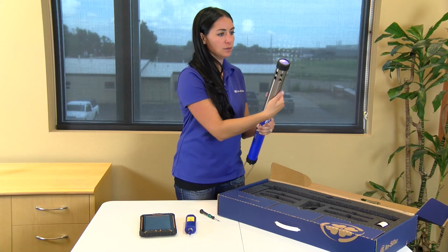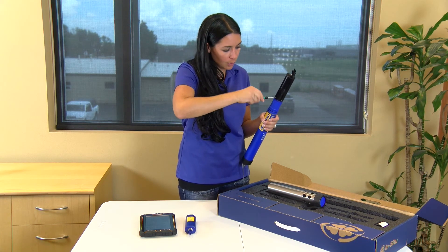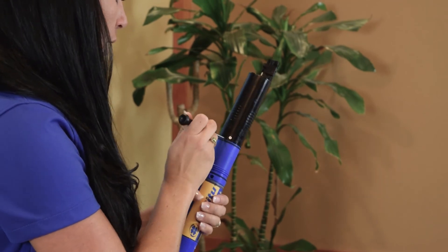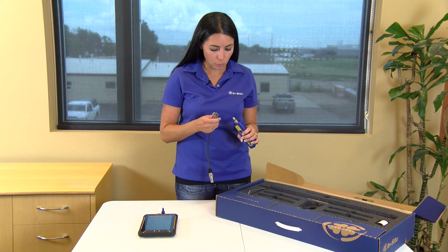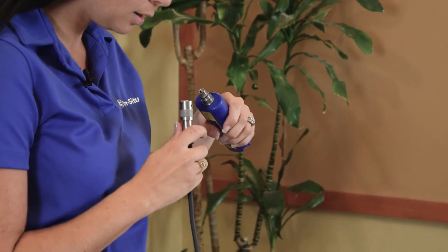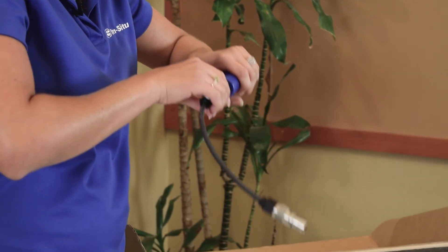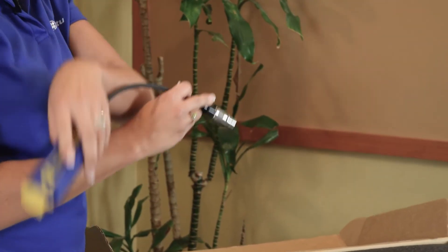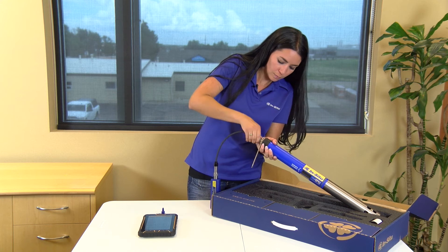Next I will show you how to remove the sensors. If you need to replace one or want to change to a different parameter type, you will remove the restrictor. Use your tool to unscrew the screws at the bottom of the sensor — there is a little hole for the tool to go in. Stick it in that little hole, push the sensor up, and it pulls right out. For installing your cable, these are twist lock connection cables that will lock into place. They are keyed, so when making your initial connection, look for the flat part on your connector as well as the flat part in your cable, line those up, and it should slide right in. Push the connection down as far as possible, slide until it gets into the curved area, and then click into place. That ensures you are completely locked and sealed. Take this part and attach the other end to the instrument.